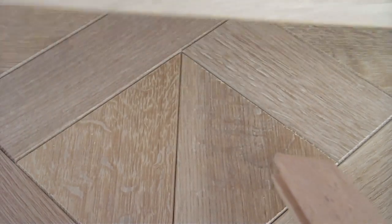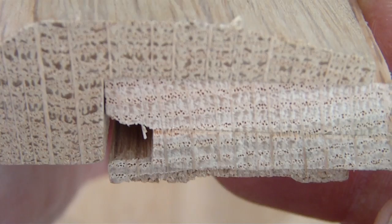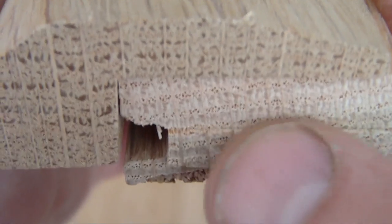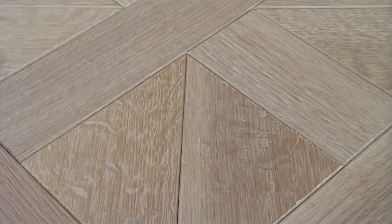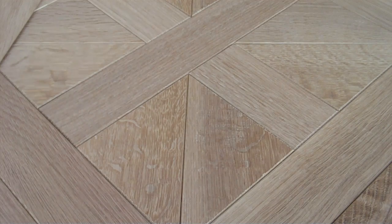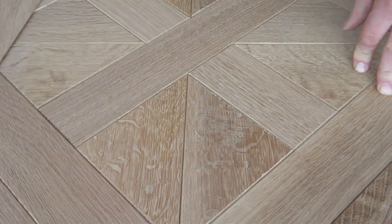Now by comparison, I'm going to lay the white oak over the red oak. See the difference? White oak's on top, red oak's right here. But even that can be deceiving, because I have found — maybe other floor guys out there will agree with me — that as we harvest younger and younger growth, there can be plenty of pinholes even in white oak.